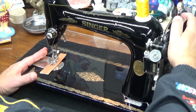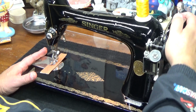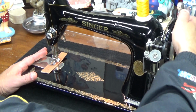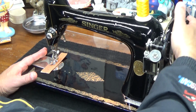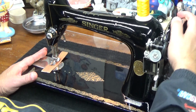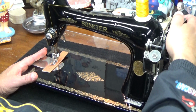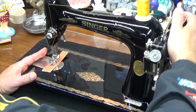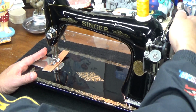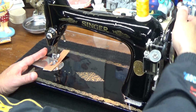And as you probably know as well, Class 66 machines do not sit level. So like Trapper Jack's machine, the 66-8 that you would have seen recently premiered, this one has a furniture sliding pad on the rear of the machine underneath that pedestal foot to give it more of a stable sewing base. And I'm not sure how eventually Mark is going to set this up, since it doesn't have to sew for him. We'll wait and see.